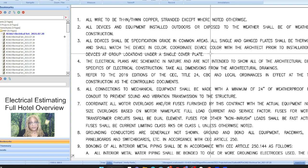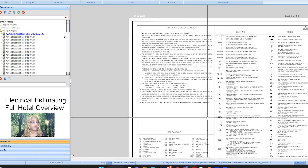The measurements help us determine the cost of the project, right? And the specifications, which I went over in real good detail with one of my HVAC students, are intended to give you information about the material. For instance, for HVAC, what gauge sheet metal are you going to use? 16, 18, 20, 22, it's all going to be stated in the specifications. They may take portions of that and put them here in the general notes, but it is vital that you read the specifications.